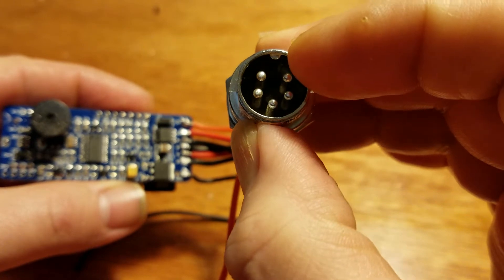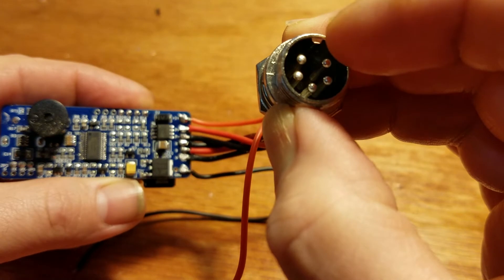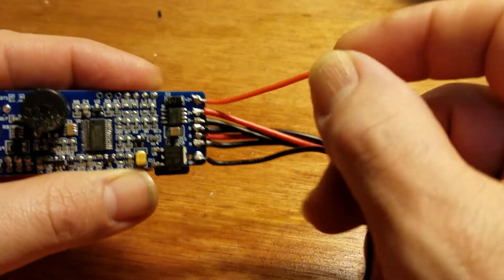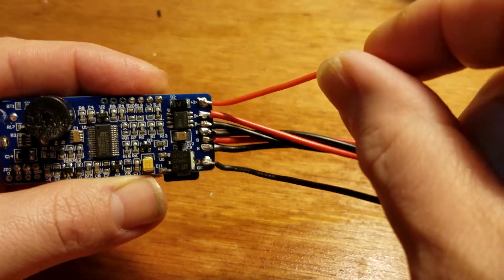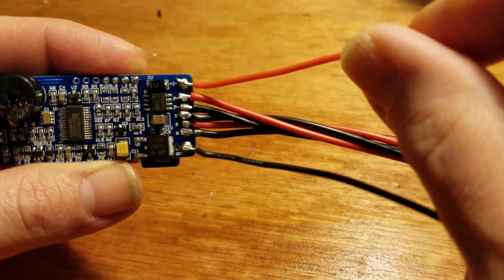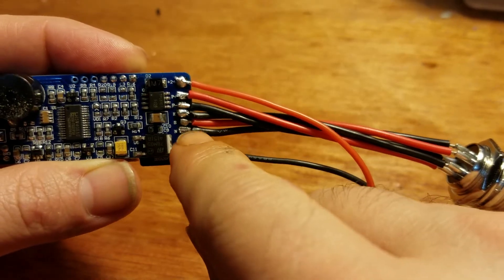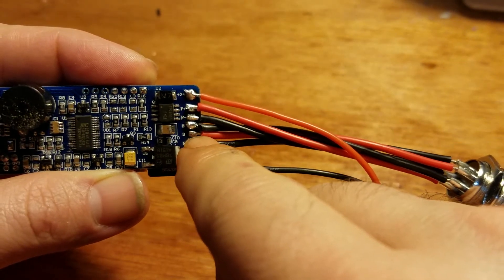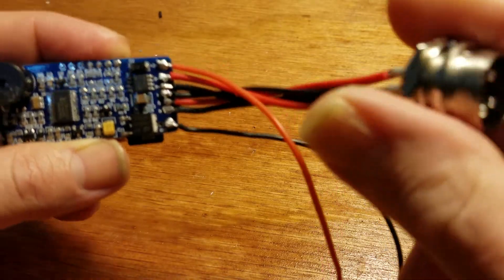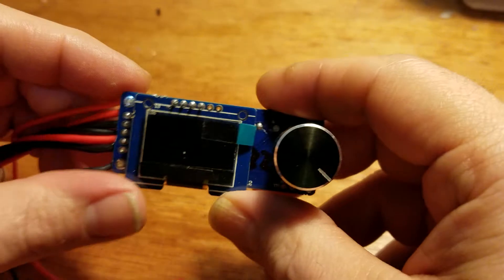The connector is numbered one, two, three, four, and five. The top two outermost ports are your 24-volt input — positive on top, negative on the bottom. Then for your plug, starting from the bottom, go one, two, three, five, four — and that is the correct way of hooking one of these up. Hope that helps you out and enjoy.